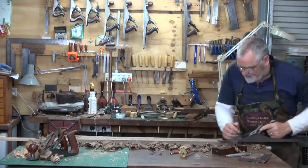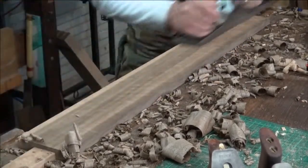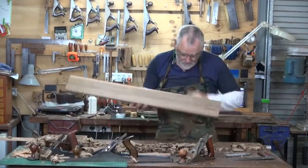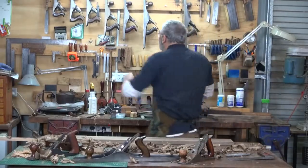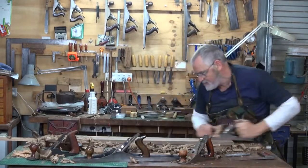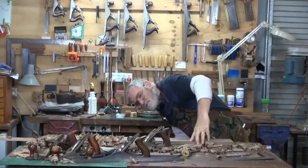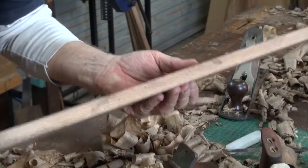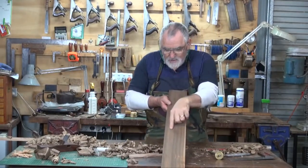But we just want to get back to flat again. Just this edge along here needs to be done. I might use a smaller plane on that. I'm right on the line all the way along. Now what I've got to work out is where I'm going to put a slot down the front. I need the slot so the plate isn't just sitting on a flat bit of timber where it can slide off — it's got to be a recess.